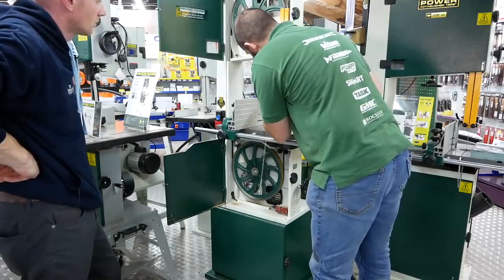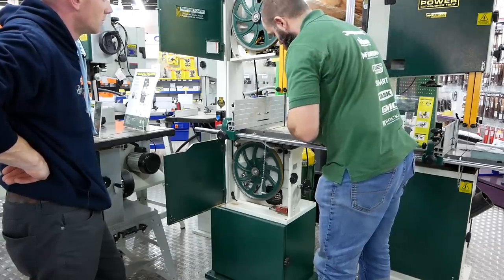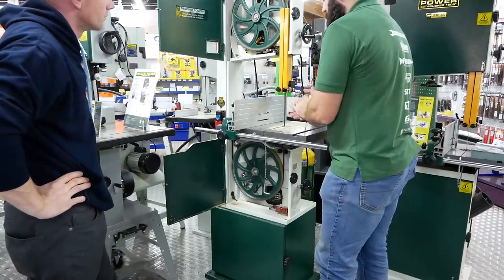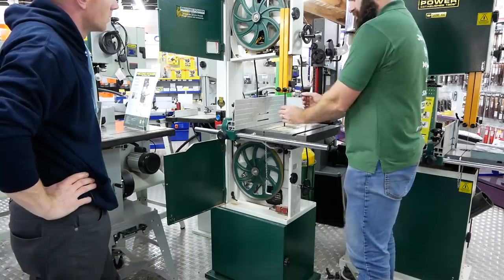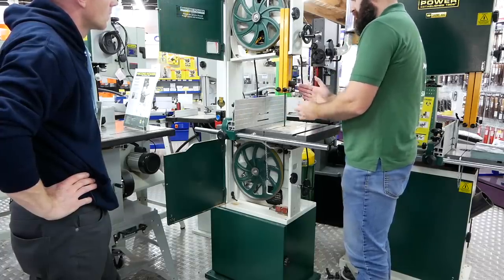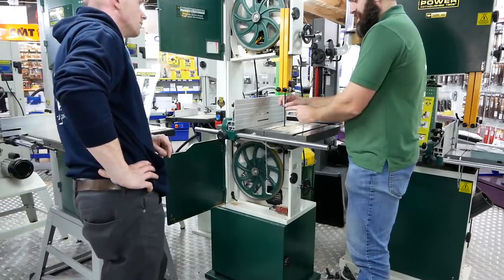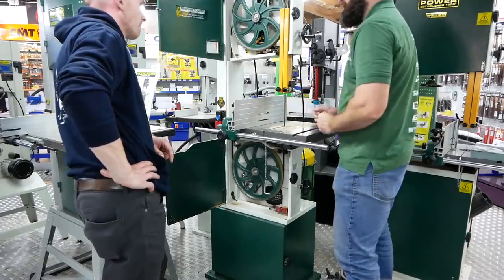If you need to release the tension from either side of the blade — when you fit your bearing guides, the quick release ones — you push it against the blade, back it off a little bit, and then tighten it up. Both sides the same, and underneath as well. Is there a specific distance? It's literally just a hair off it on both of them. There is a difference depending on the width of the blade — it depends on whereabouts you need to set it, whether it's near the front of the teeth or near the back of the teeth. You can move this whole section forwards or backwards, and that's partly what the cam lock is for. The bearings need to sit just behind the cutting point — so on a 5/16ths blade, if you put a quarter inch blade, you might be touching the cutting point. You just need to be aware of that when setting a blade.